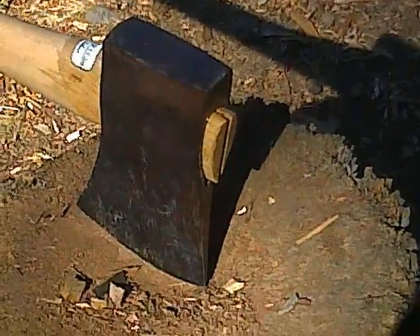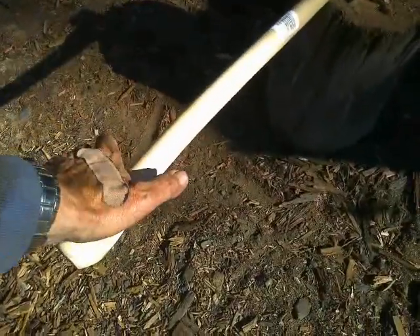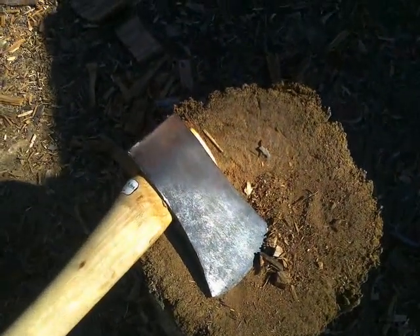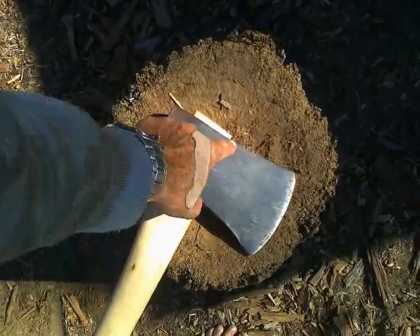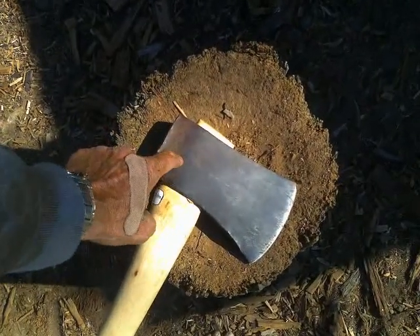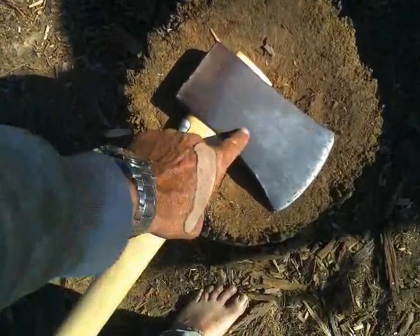However, what it means is that any time for the rest of its life after it's fitted, the axe gets stuck in a block of wood. When somebody attempts to use leverage in order to rap smartly on the heel in order to dislodge the stuck axe, what that does is set up a situation where there's a good tight fit along here, but you've got a V-shaped arrangement here and this becomes the fulcrum, and effectively you've got room for movement and the whole wooden handle works like that because it can, because it's got room to move.